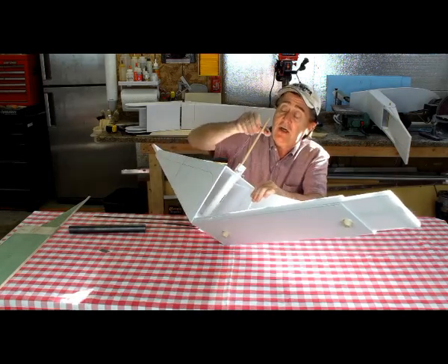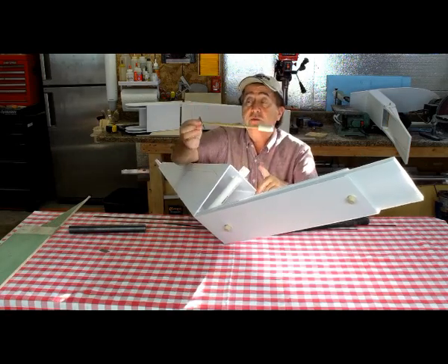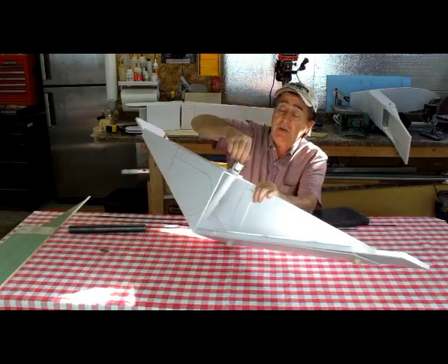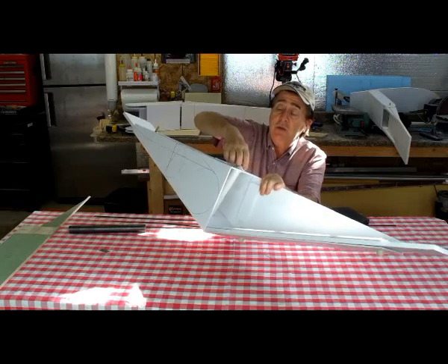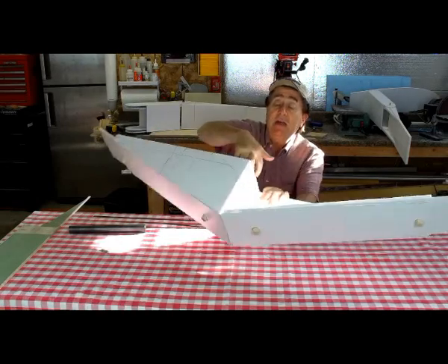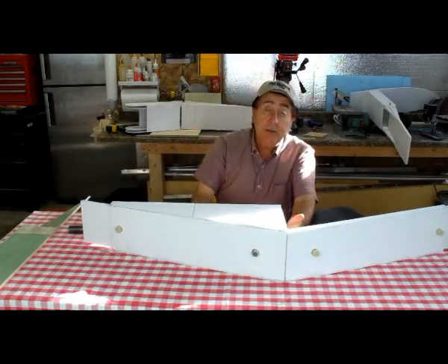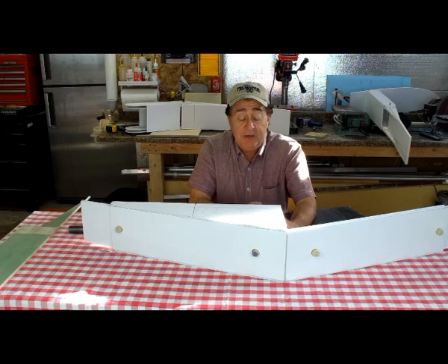The plan was a quarter-turn, over-center kind of latch, where the shear pin would be on the end of a rod with a little cross piece. The tube would help align it with the fitting, you'd do a classic quarter turn, a spring pulling it back would lock it in place — all four pins done that way. The guide tubing would obviously be thin-wall fiberglass tube, very lightweight, simply to guide that pin in place.